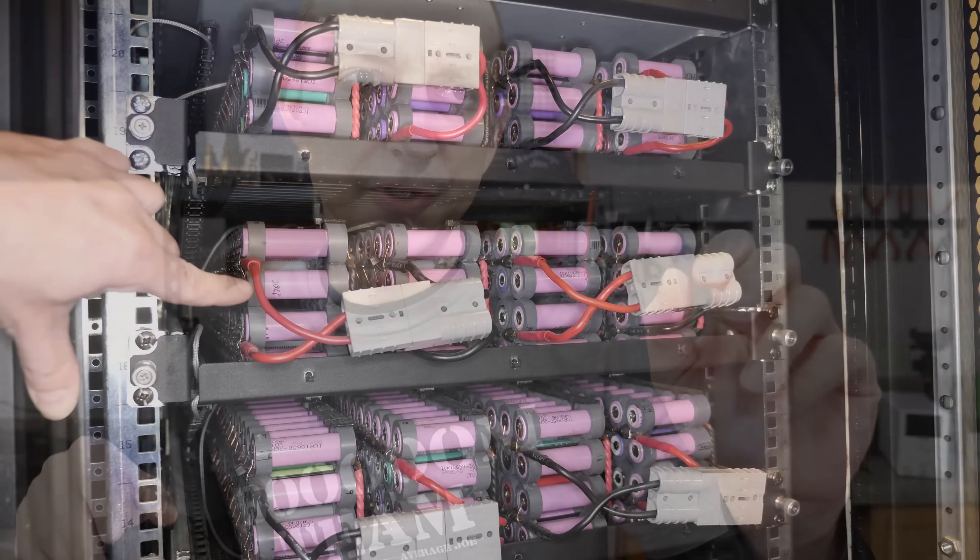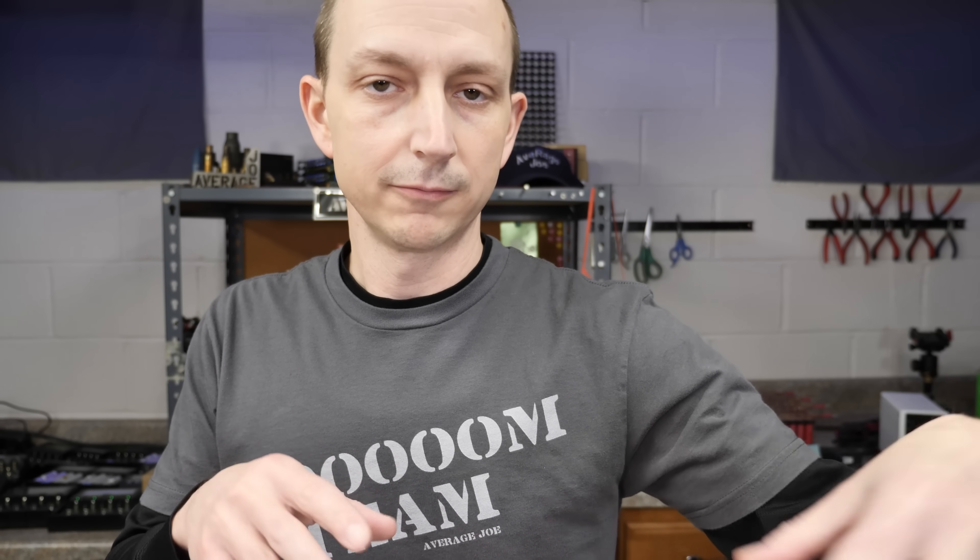So what are your guys' thoughts on all of these prismatic cells? I am super excited because — not that there's really anything wrong with my 18650 DIY Powerwall — except for my little wiring problem. It's not really a problem, it's just I didn't see that far in the future. If you weren't aware, I put two 10-gauge wires coming off of each battery pack. 10-gauge wires are really only for about 30 amps each. I've got two of them, so technically I can only run my battery packs at 60 amps. It wasn't really a flaw — it was just something I didn't see far enough in the future that I would have a big enough inverter to run my house, which I do now. So I just can't run huge loads from this battery pack, which is fine.